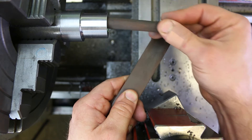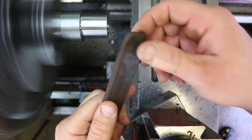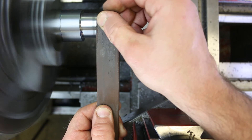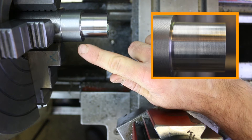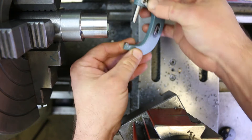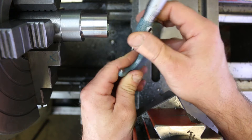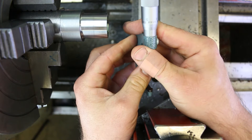Let me touch up half of this diameter so you can see the difference. Put it down on the surface and move it back and forth a little bit — it won't take much. You can already see the difference. This surface is noticeably better than just the finish that came off the cutting operation. Let's see if that made a difference in terms of size. The untreated side is 1 inch 161 and 4 tenths — measuring the Cratex side gives the same reading. No change — that's good.